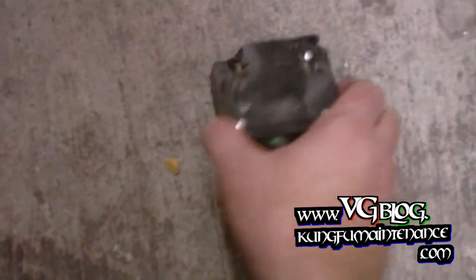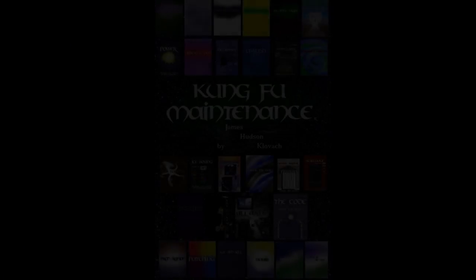We'll be back in business. There it is — the broken-off breaker, completely broken off. So it was only getting one side connected — that's why one leg was connected and we had 120, just not 220 or 240. All fixed, good to go.